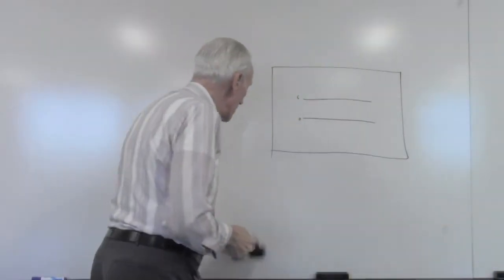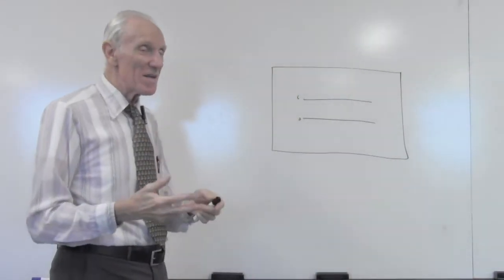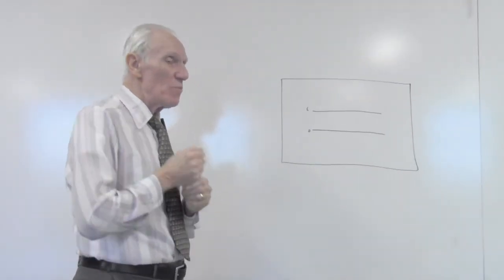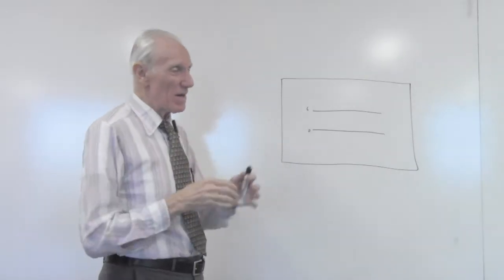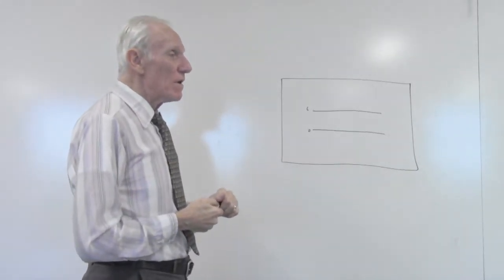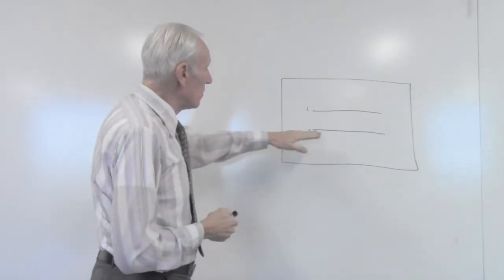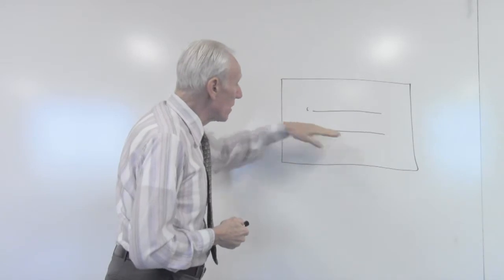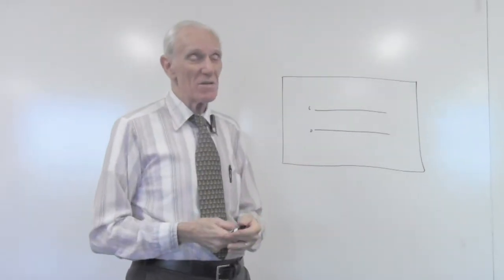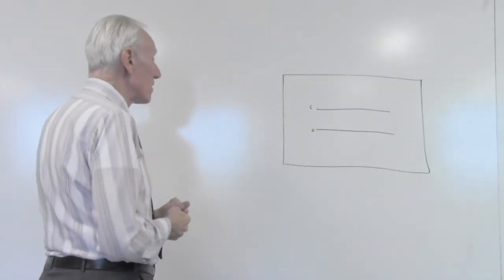So, analyzing this, again, it's semi-quantitative. You can't do a percent error to 1.3% or something like that. It's kind of crazy. You can do a discussion of the error and so forth, because we always like to do that. Okay, so this is the zero volt equipotential line. This is a 6 volt equipotential line. Equipotential means it's at the same voltage. Voltage and potential are very closely related.